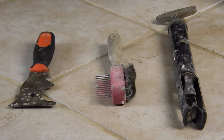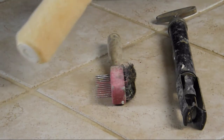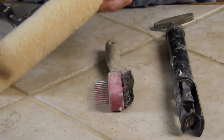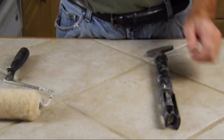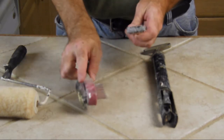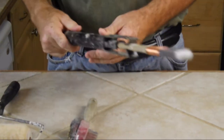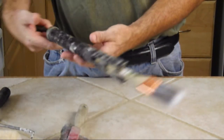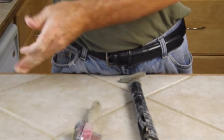A fast paint job requires a fast clean up, and clean up means you have the proper tools to clean your tools. You need absolutely these three items right off the bat, besides a hose with a nozzle. First, this is a painter's knife — it fits your rollers exactly and you use it to get the excess paint off. Second, this comb is used to comb out the paint and get dry paint off the brush — very necessary. And third, you cannot live without this spinner tool. It's about $15 to $20, and after you've washed the brush, it spins the brush and also spins a roller.